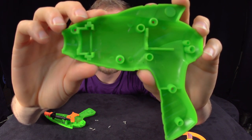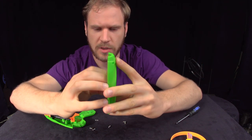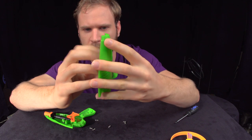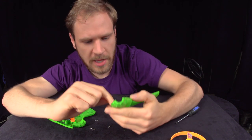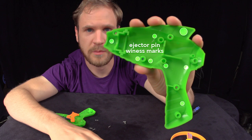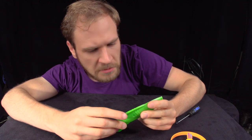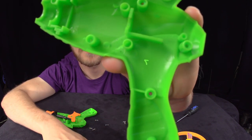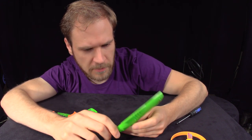Those are ejector pin witness marks. So when this piece was being made in a mold, there's two halves to the mold — the core half and the cavity half. When the part is molded, it sticks to one half of the mold and you have to push it off, so there are pins that are pushed onto the mold. You can see where those pins contact the plastic. So this is for sure plastic injection molded. There's also a number — kind of looks like a backwards number seven. Not really sure what that means. Could be a mark for cavity number seven in the mold, or some sort of internal mark that means something to the people who made them.